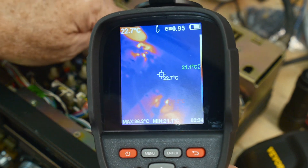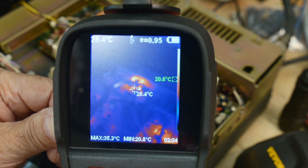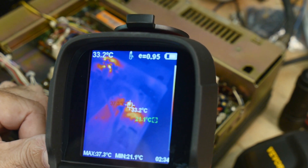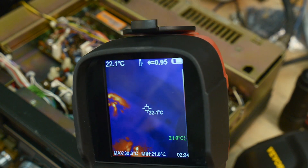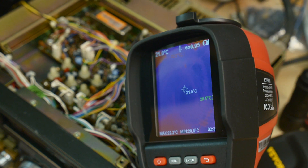Here's a radio that's on — you can see a hot spot where there's a TO-220 transistor on a heat sink getting up to about 35 degrees C. You can kind of look around and spot other hot areas. It's a really good tool for troubleshooting. Now that I have thermal cameras I tend to use them quite a bit to see what's getting hot. These aren't cheap at about $300, so you have to think about whether you need one, but I do believe they add quite a bit of functionality to an electronics lab.